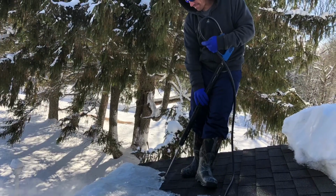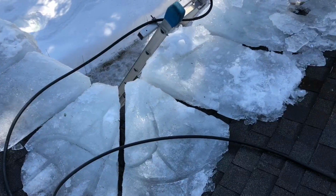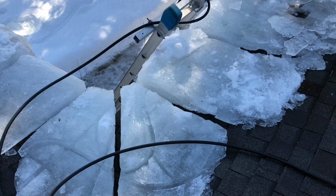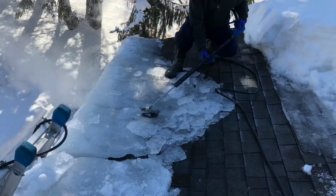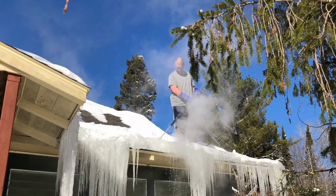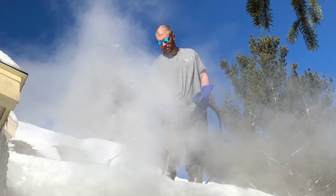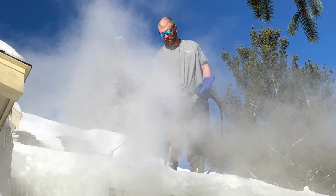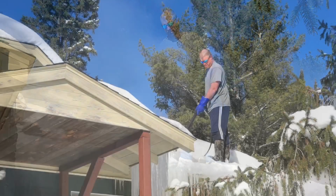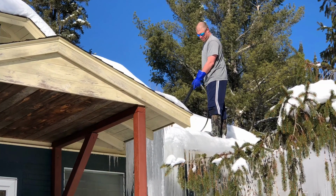We only use safe, low-pressure steam equipment that runs at a maximum of 100 psi and steam temperatures up to 300 degrees Fahrenheit. These are the correct parameters for low-pressure steam equipment. Our steam equipment runs on electricity and is kerosene fired. If a company comes to your job and doesn't want to use your electricity to power their machine, it is more than likely a hot pressure washer.